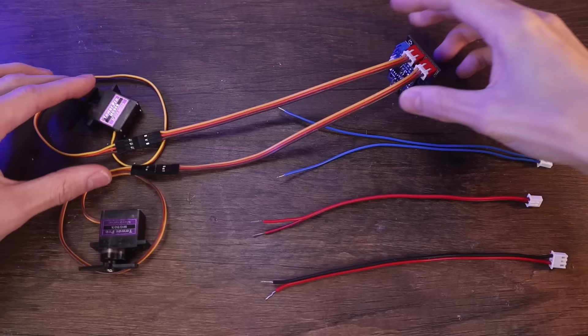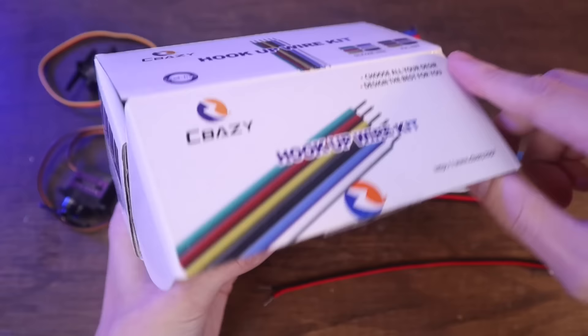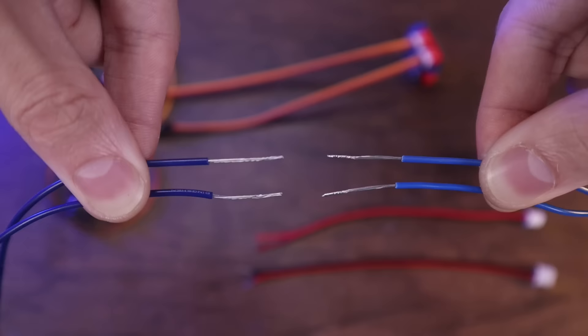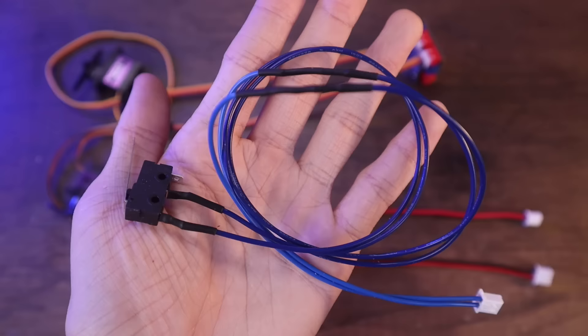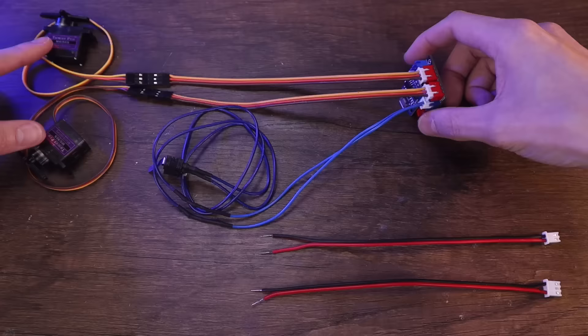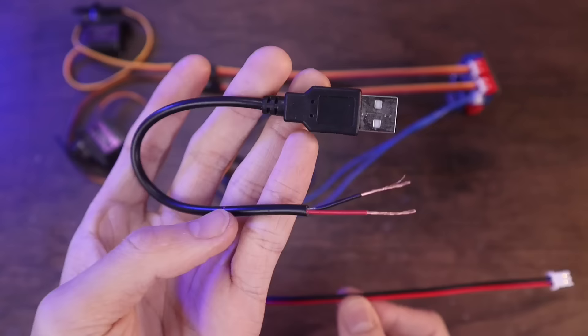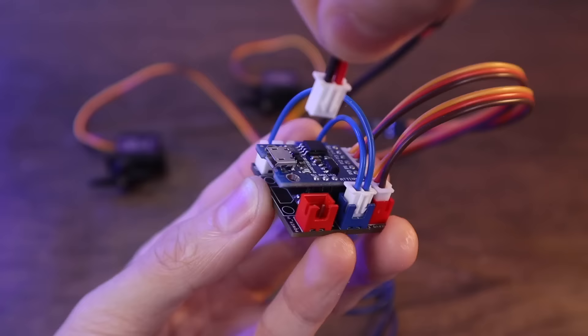By the way, all these cables came included with the board. See this blue cable here? It's just a little bit too short, so I'm going to make it longer. And afterwards, I'll solder on another limit switch. In this case, it doesn't matter which wire is connected to which terminal, as long as one is connected to C and one is connected to NO. We just simply plug this limit switch into the board like that. There are two more cables left, but the one with the bigger head we can just get rid of because we won't be needing that in this case. For the remaining one, I soldered on another USB cable so that the board can be powered.